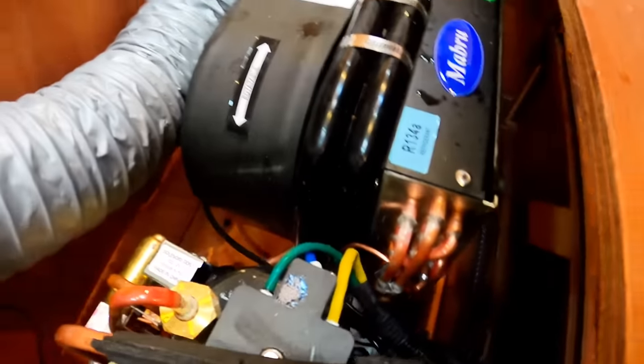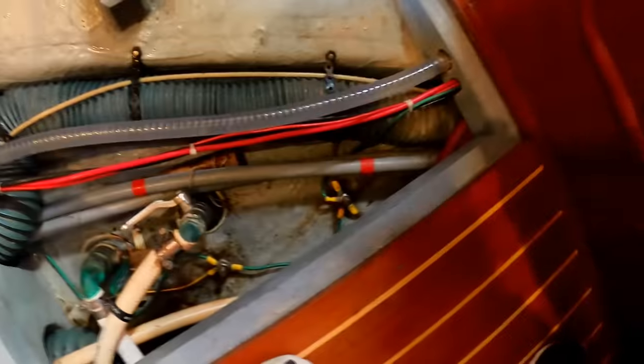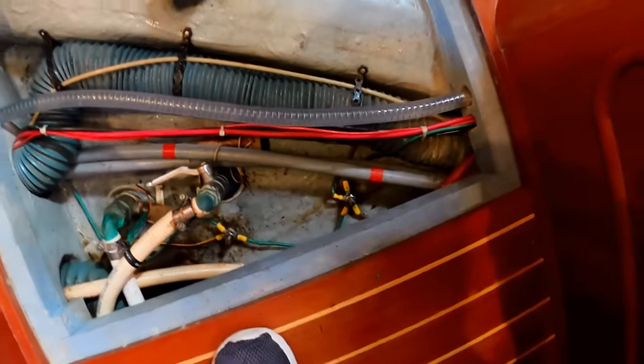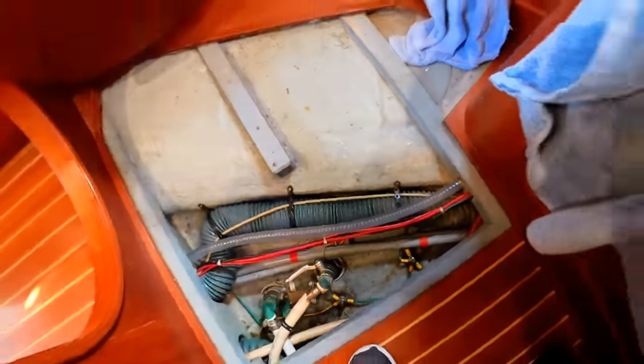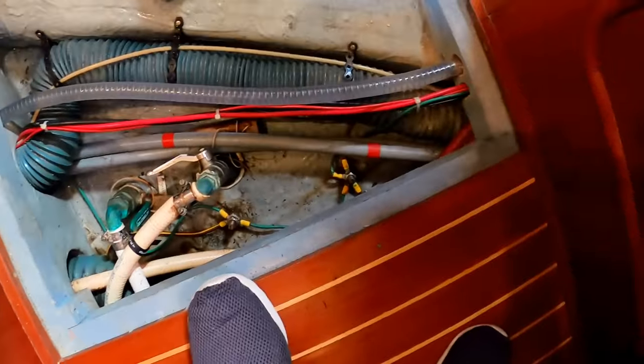It's kind of hard to see, but we do have our unit grounded down there the way they ask for. Here you can see the ground wires going into our grounding plate. These are actually grounds for both air conditioning units, plus the rest of the boat.